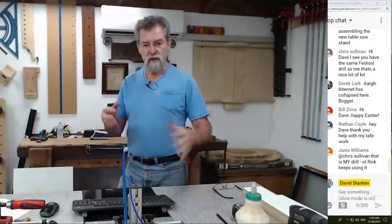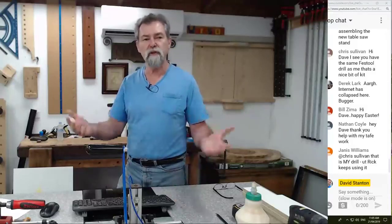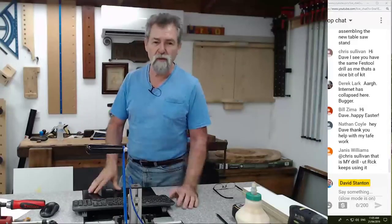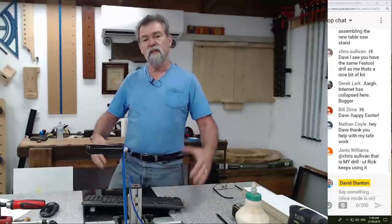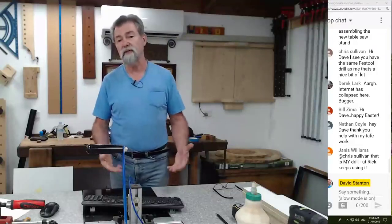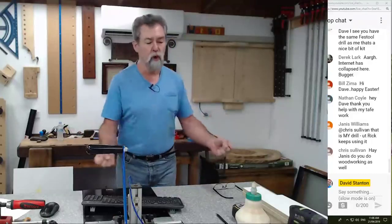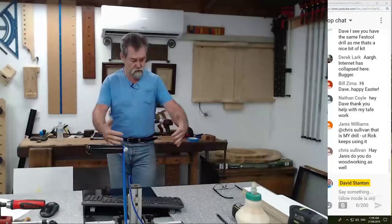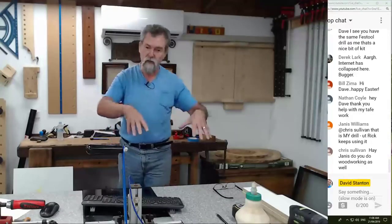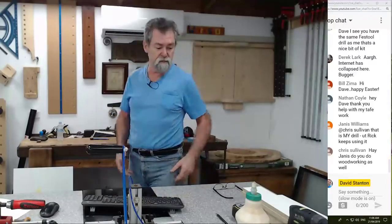Well, my problem with that was I've got Jarrah doors on all the cabinets, and I didn't want to destroy them, and they weren't big enough to turn sideways at all, and it was just going to look like it was jerry-built. So what I've decided to do is leave the doors on, take all the shelves out of the cupboards, and I'm going to use some of those shelves as drawer bases, and I'll show you how I'm going to do the drawers with this. And I'm going to have three full extension drawer glides that will let me pull the drawer right out. So we're looking down on top of what's in the cupboard, not ferreting around up in the back and seeing if we can find something, like the Raiders of the Lost Ark, looking for the Holy Grail.